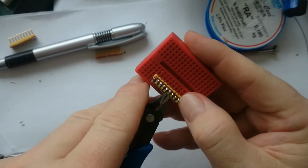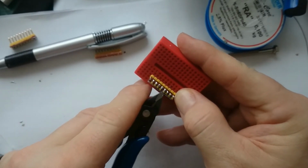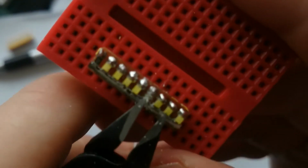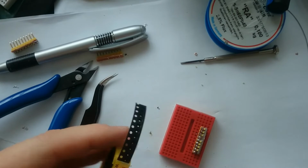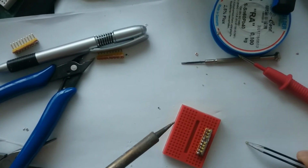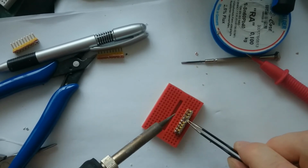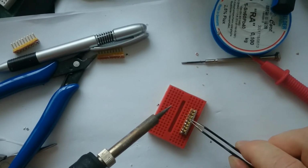If you need to replace a defective LED, it is easiest to cut the LED off using these sharp snips. Then clean the area prior to soldering a new LED. Soldering such small components may require some practice, but I find the 0805 size quite doable.